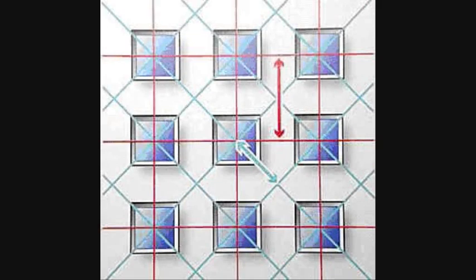Now, in the back of your camera, in the past, it would just be block, block, block, block of pixels. And it would be maybe a whole line of green, and then above it would be red, blue, red, blue, red, blue. And then a whole line of green, then red, blue, red, blue again. And that was fine, but people could really see artifacts coming in their images when they did that. So they then developed the Bayer pattern, which is effectively the same kind of thing, but instead of having it block, block, block, the rows are offset, like this.